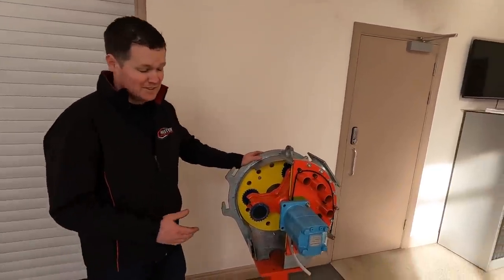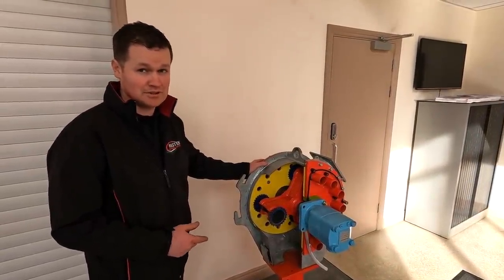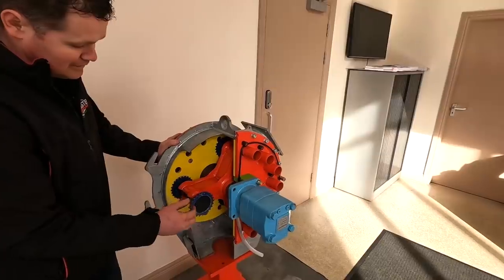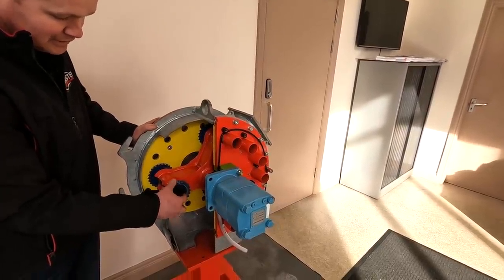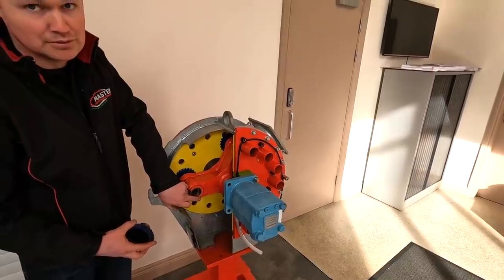Yeah, so this is the Mastek Supercut Macerator. September 2017 at the Plough Match, we launched this initially. A hydraulic motor is driving around this red axle. And inside that then, you have these six blades. And the blades are free spinning inside a brass bushing. So you have no grease point.